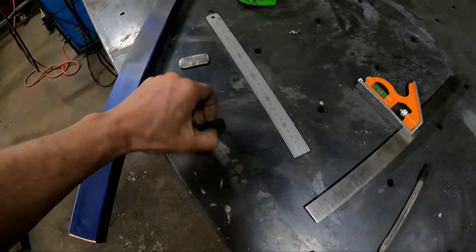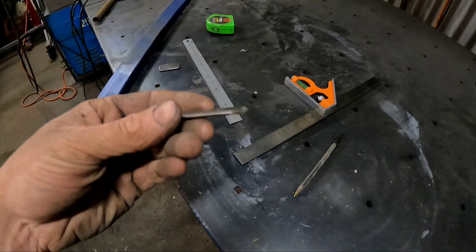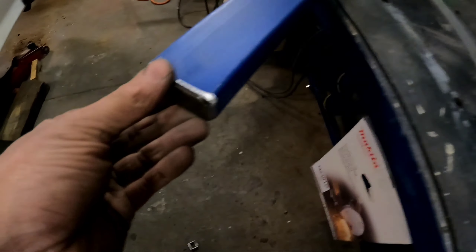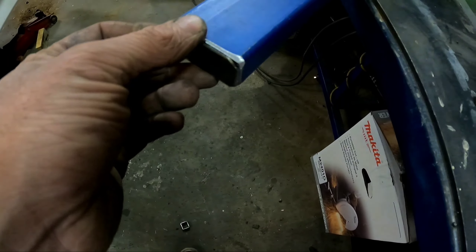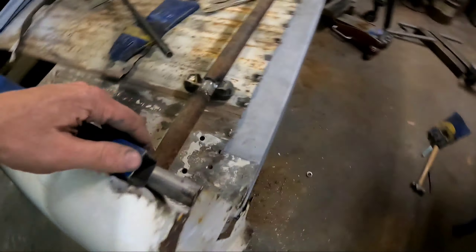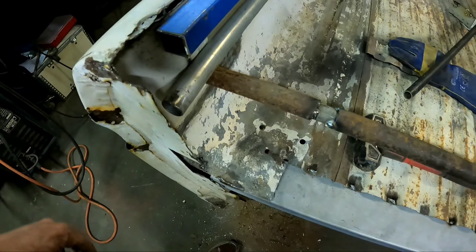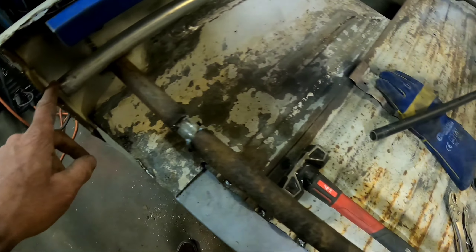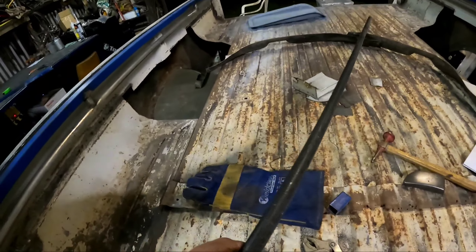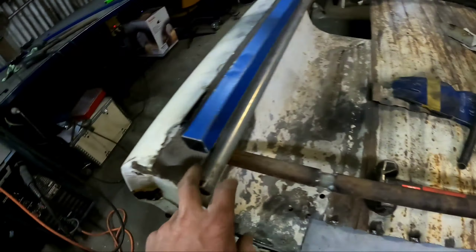So I've got this beam prepped up ready to go. What I've got to do is cut the ends — I've just got some bits of 25mm by 3mm flat, just taper the edge, try and get the weld in there. So that'll just go in like that, weld it on, grind it up, and then I'll shorten all these pieces as well so it'll fit in there. I'll just have to weld around that and then that's all joined together. And then I've just got to figure out the tube as well — I've still got a few of these little uprights there, so this beam should be right to do the job. Once all that's together I'll weld it all together, and then weld it to the tub.